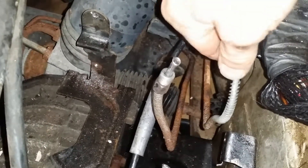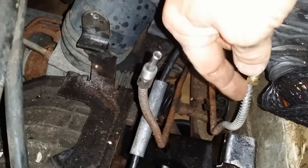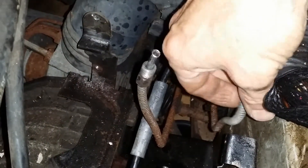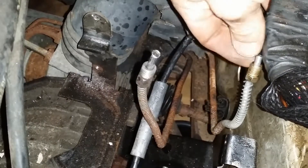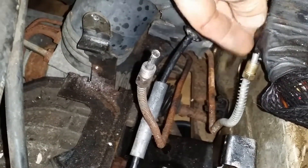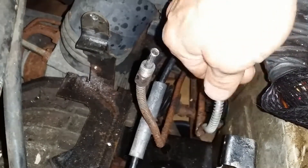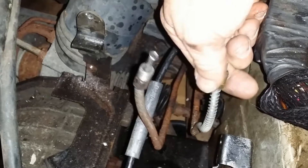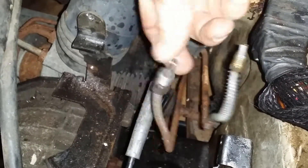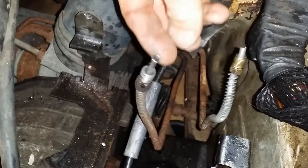One trick you have to be aware of: you need to pull the metal spring up — this is basically a spring that wraps around your hydraulic line to protect it — so you need to pull this all the way up and then cut it off with some sort of trimmer. This one I probably didn't get far enough up because I can't get my tool in. This one is down the proper length because I already finished this one.